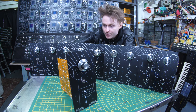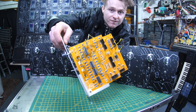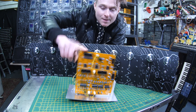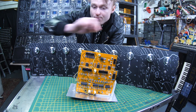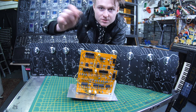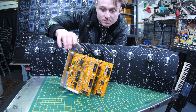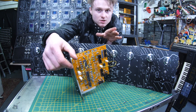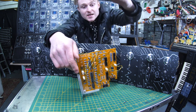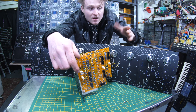After 10 days of pure slog they're all done. This is filter 4A, corresponding to the fourth row on the first filter. The backboard is the same board from the routing matrix output, except it corresponds to different switches on the patch bay — so when you flick the switch, this filter turns on. It looks more complex than a usual filter because of the syncing features; all the modes need to be synced for it to be a functioning polyphonic filter setup.